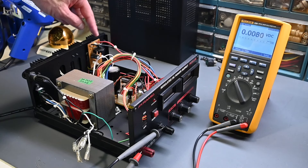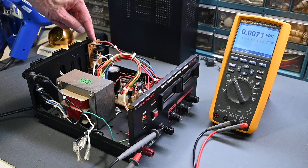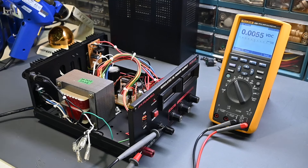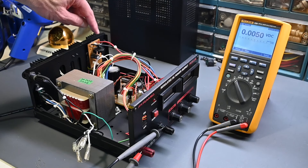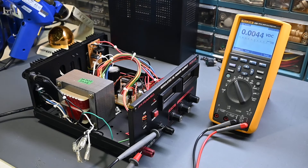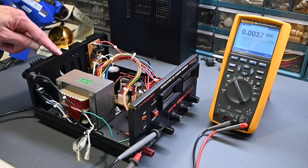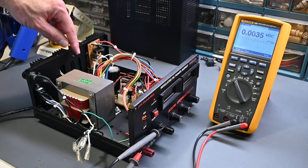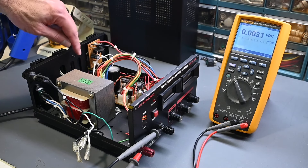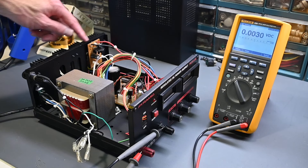That actually tells us quite a bit. It didn't draw excessive current until the AC line got above 90 volts, and then suddenly it tripped. This points to the over-voltage protection module — it very likely tripped because the voltage was well above the rated 30 volt output and exceeded that by a fair amount. So it looks like this crowbars the output, and that's probably when the fuse blows. But the real question is: why are we not seeing any voltage regulation? I'm very suspicious that we have a defective series pass transistor.